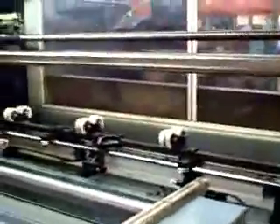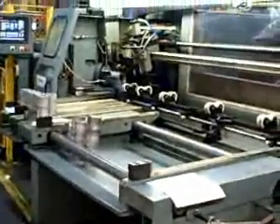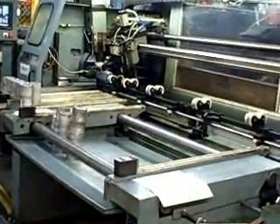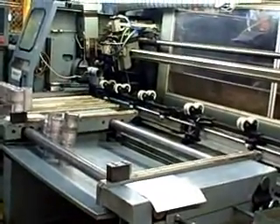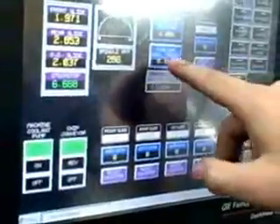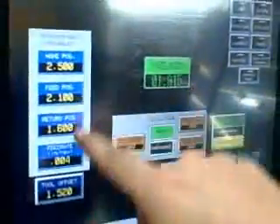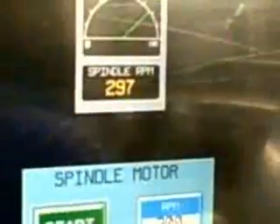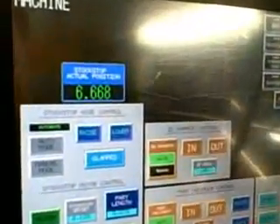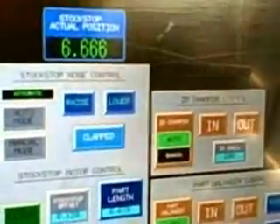Main screen, okay? You've got your diameter, your wall thickness, and you set your slides — set your start, your feed, and your home positions, your speed rate, rear slide, same thing, overhead slide, your OD chamfer, same exact setup. Set your spindle speed and all your bar feed stuff, your 24-foot intake table and all that from here. Then you can do your cut-off length, your ID chamfer, and your part unloader. And that's pretty much it.